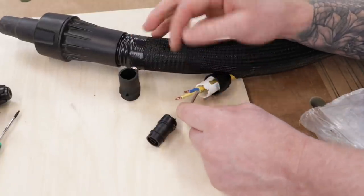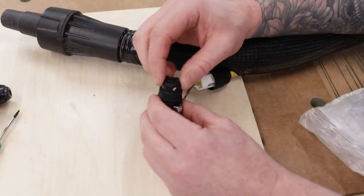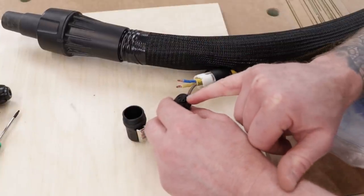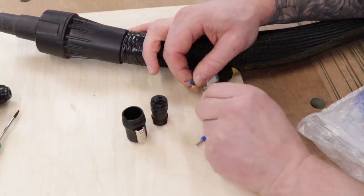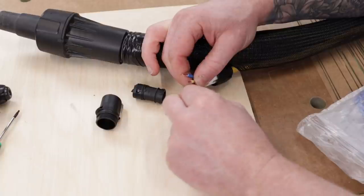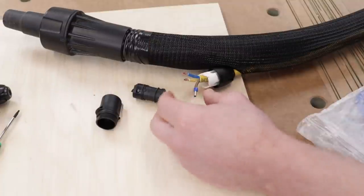The socket end goes together much the same as the plug, just with different locating pins. Inside it has one large locator for the connector to fit down inside - rotate it around until you find the slot, as there's only one way it can go, ensuring live, neutral, and earth line up on both sides. The connections are nice and robust, so I'm actually going to put ferrules on these cables. All flexible cables should be ferruled, but if you don't have them, do a nice tight twist connection - every strand of copper should be down inside the terminal with nothing sticking out.